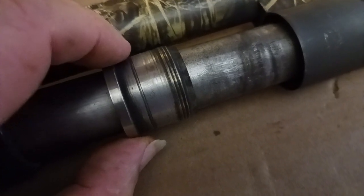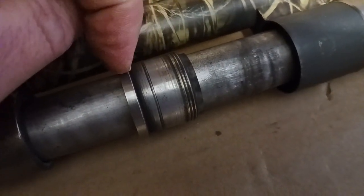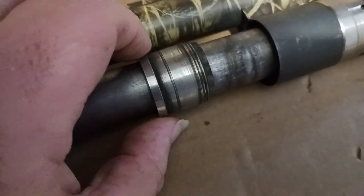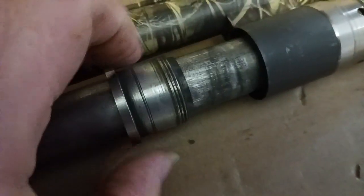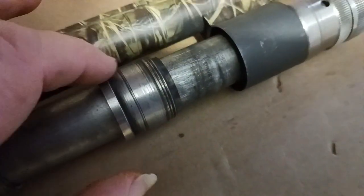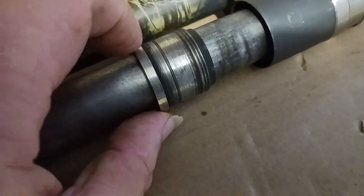If you look at this — look at that moving up and down on there. That's because this piston is tapered from here to here, and it has an internal taper that parallels it, meaning that no matter what position it is on the gun, it will go in here and it will fit. Now, this diameter here is close to the inside diameter, which allows it to seal off. And as you can tell, it seals off by the scraping motion. And then, of course, when this closes, it's sealed here.